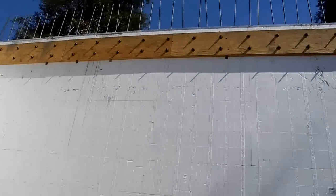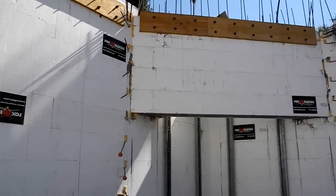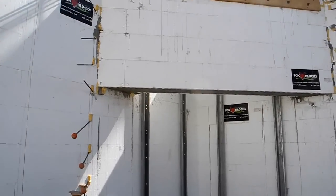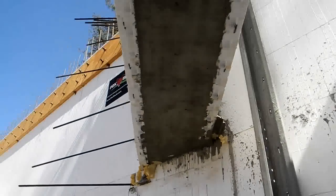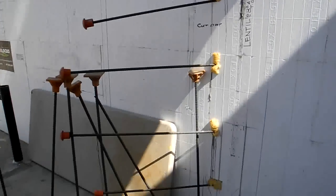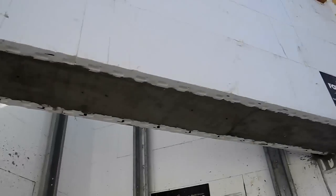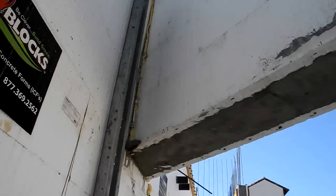It's solid that way. One of the cool things the architect and the structural engineer were able to do was a 45-degree beam up in the air attached to the crossing walls, and a 45 right off of there — that's with a big beefy 12-inch core Fox Blocks. They're also going to have 8-inch core walls coming off at a 45; they'll come back in and form those up a little later this week. That was all done by field cutting the forms, stacking, and temporary bracing.